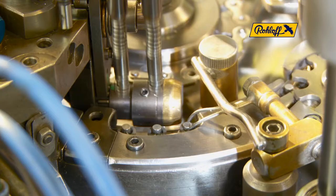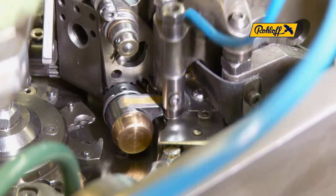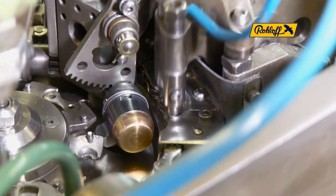On the left, next to this, a flipper grips the second inner link plate from the rotary disc and places this onto the chain. A second flipper is responsible for carrying out the same operation with the second outer link plate.